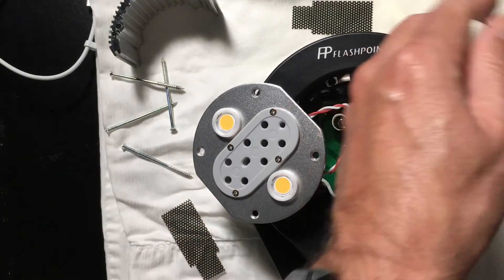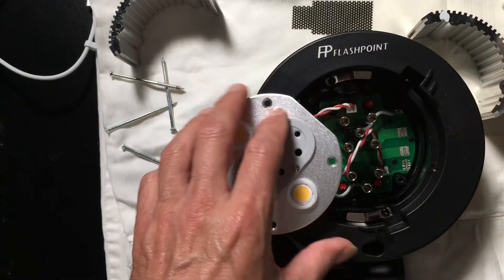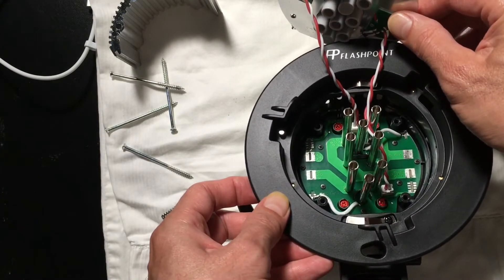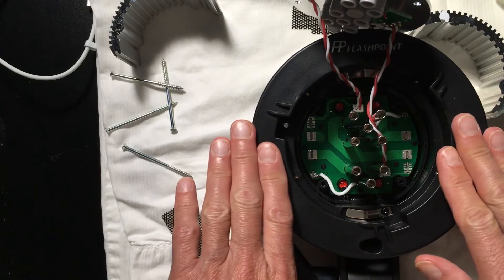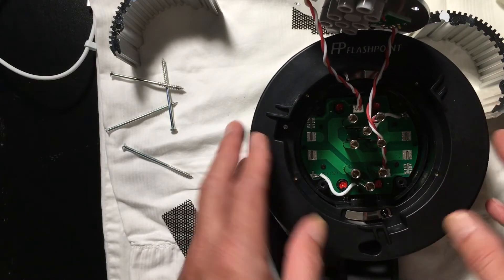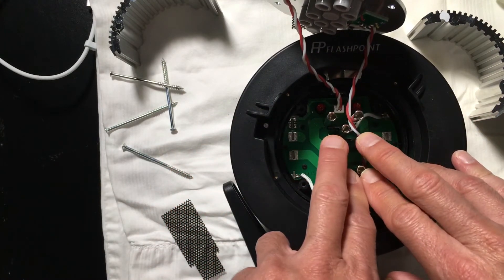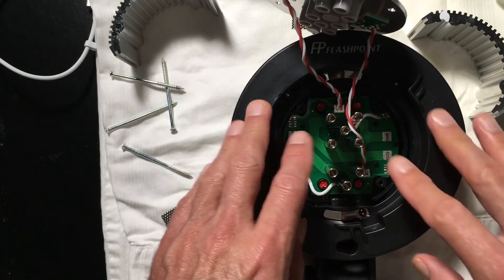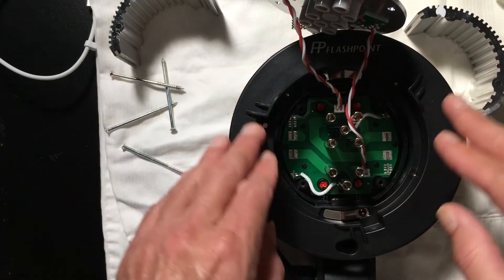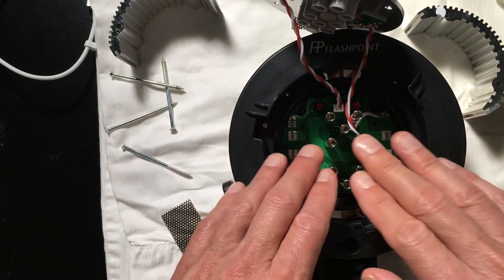I'm going to pull these insulators out. They're not tied down anyway and can be very easily replaced — it doesn't take but a few seconds. Now, as one of the YouTube videos will tell you, there was probably a very good reason they opted late in the design process not to support that 360 tube. The reason, I suspect — and I have to agree having looked at the design — is that the 360 tube that fits in here is very similar in construction to the 180 watt second tube. If you were to force that into these pins, which were designed to support the 360 by bridging the two power units on the back, you'd overpower that bulb and very likely blow it out or cause it to shatter catastrophically, which would not be a good thing.